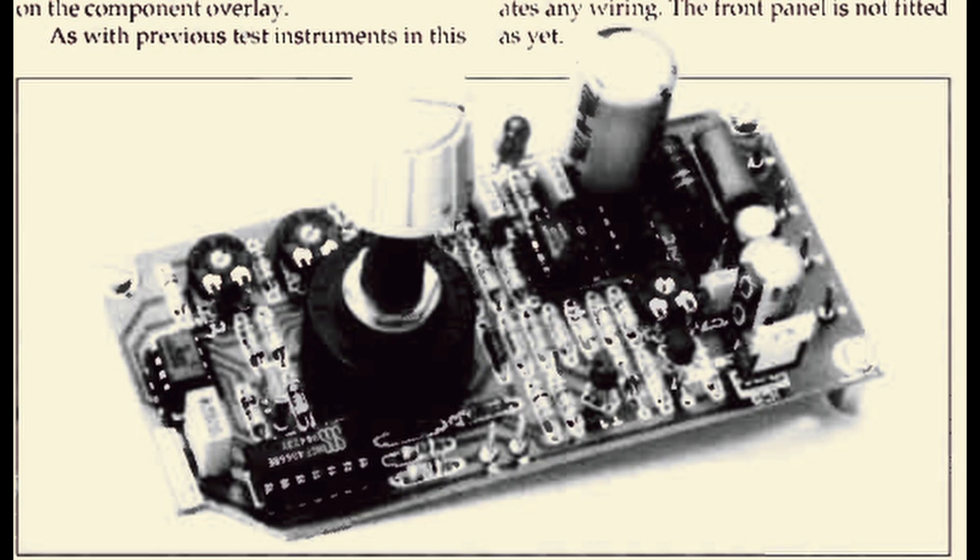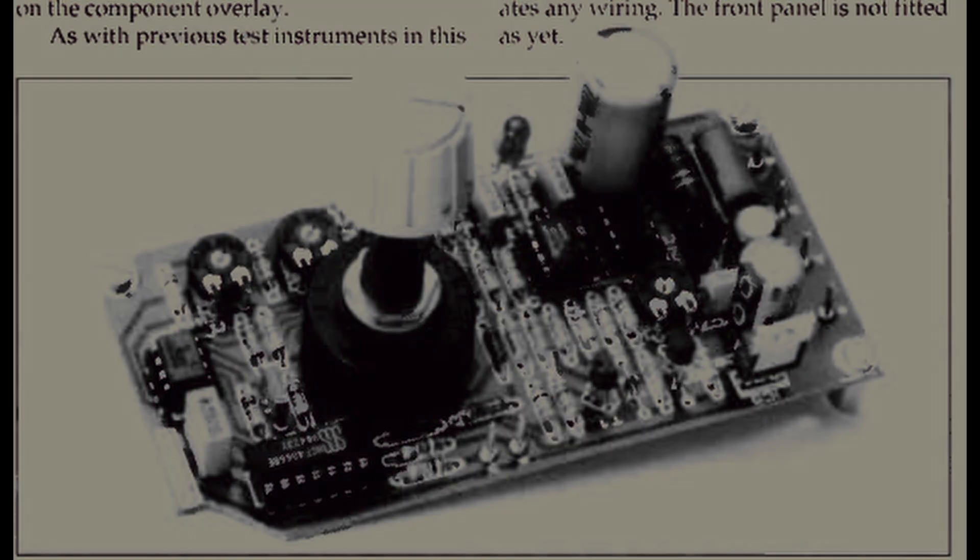As we know, a normal multimeter is not the greatest when it comes to the milli-ohm range. The test lead length alone would probably introduce some resistance, the oxidization of the banana plugs might increase resistance, and there could be a whole bunch of other factors too.